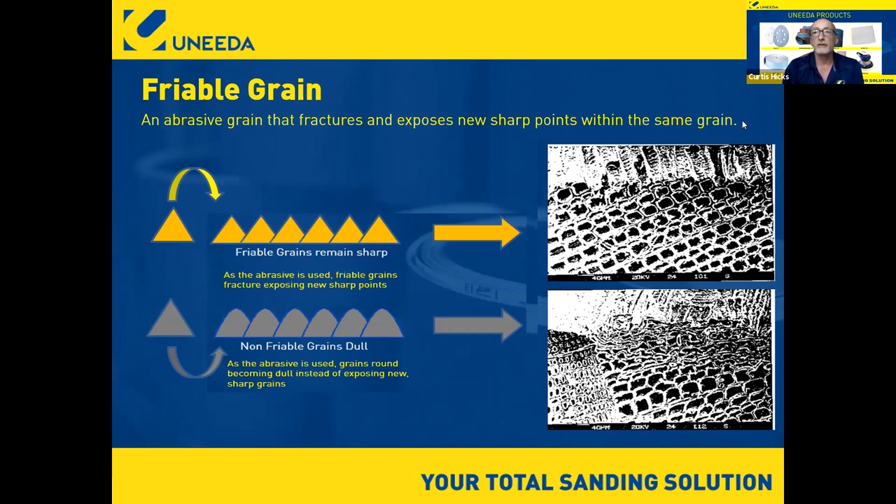These pictures are real. We took photos of a part cut with a friable grain and a part cut with a dull grain, then magnified 40 times. The friable-grain result should look like you bundled a bunch of straws together and looked down at the top — all the grains are opened up very consistently. When you put stain on that, you're going to get a beautiful, clear, very consistent color because we have shaved all the grain off and opened it up.